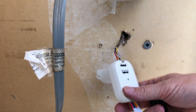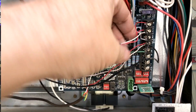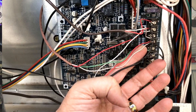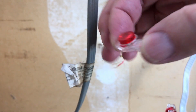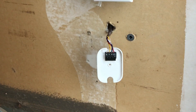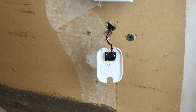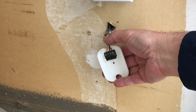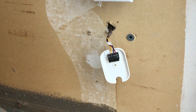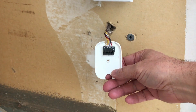For the installation, we're going to start with the PEK. Before you do anything, I suggest you take pictures of your wiring — make sure the images are clear just in case you need to refer back to them. I'm going to use these little low voltage connectors to hook in the PEK. On the PEK side, you can see where I have just four wires coming out of the wall — all these are what go up to the thermostat. We have the red, green, yellow, and white. I'm just using the blue as the green, and I went ahead and marked that so anybody in the future will know what that's supposed to be.